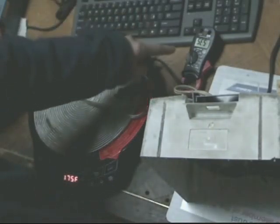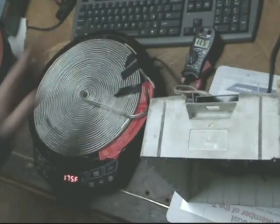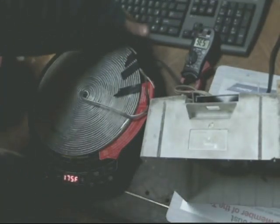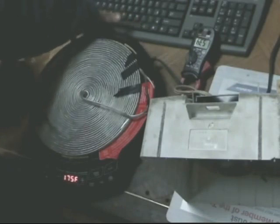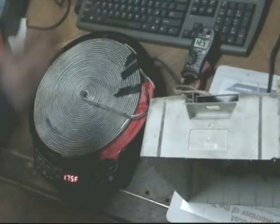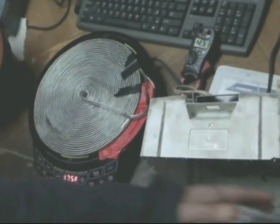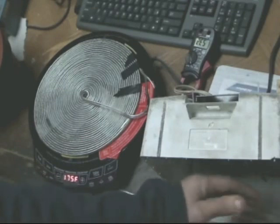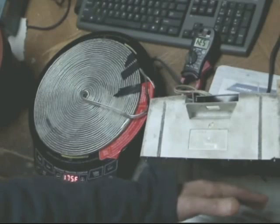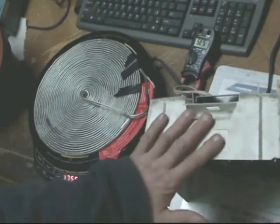as you notice, this is 5.34 amps going in. There's also about 50 to 75 watts, I'm guessing, of heat coming out the back of this. This feels more like, I'm guessing, 400 watts of heat off of the heater. This is a 43 ohm load.